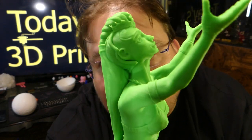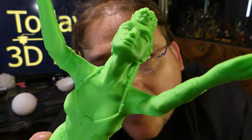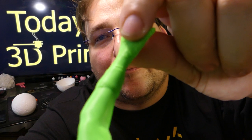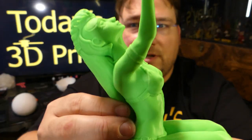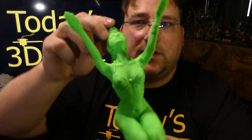I am nothing but blown away by how nice this came out. Look at her face and the crown - I don't think there is a single imperfection anywhere on this print. The only parts that had trouble were the overhangs - not bad, but not pretty. That's probably a cooling thing - this fan upgrade might fix that. Otherwise, this print is phenomenal. This filament is incredible. The 3D Solutec Apple Green is $18 a kilogram, so cheap, printed at 200°C. I am going to buy another roll - this green filament is beautiful.